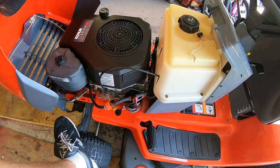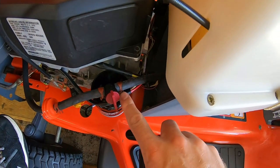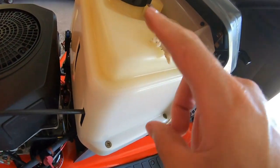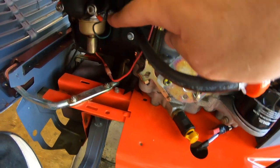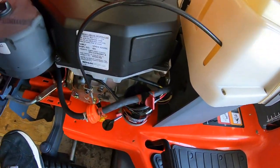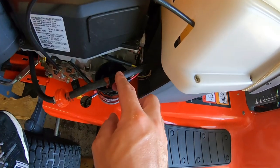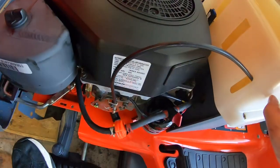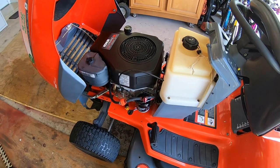This tractor didn't come with a fuel shutoff valve, but I like to install these on all my equipment. The fuel shutoff valve is right here — you can get these on Amazon. You'll need one of these quarter-inch fuel line clips. This is a gravity-fed system, and this valve allows you to cut off gas from the tank to the carburetor. What can happen is that if the float valve in the carburetor ever gets stuck open, the whole tank can drain into the crankcase and dilute the oil — essentially ruining the engine if you don't notice it in time. So every time I'm done using it, I turn the valve from on to off to prevent fuel from draining into the crankcase. That's a three or five dollar fix and very easy.